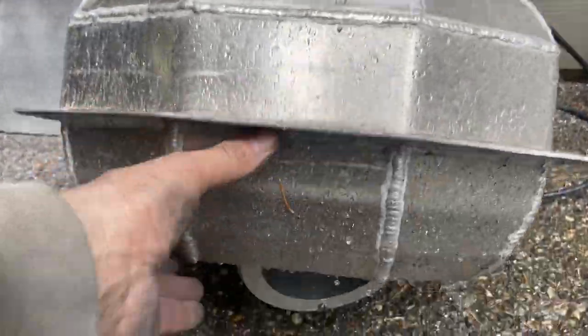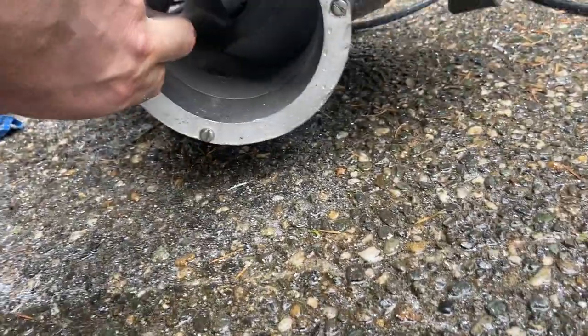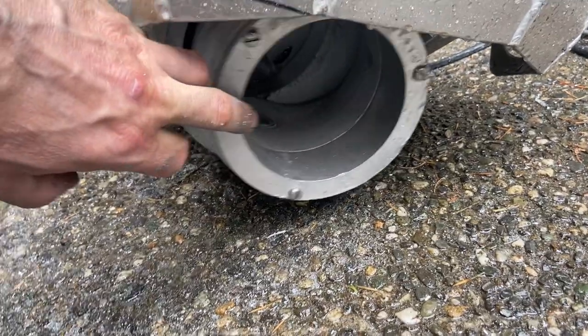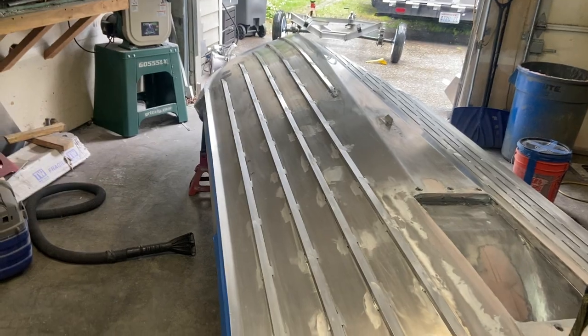The other part of the pump — the business end — is the steering nozzle. You've got this big fire hose shooting water out side to side. With the suction, with the strakes, with the reverse chine, and with the 20-degree dead rise bottom — that is how these boats stick to the water and how we are capable of sustaining 4G corners around an ordinary track and peaking at over six-and-a-half to seven G's. So here it is one more time: steep dead rise, four-and-a-half lifting strakes, reverse chine, and a big suction in the bottom.